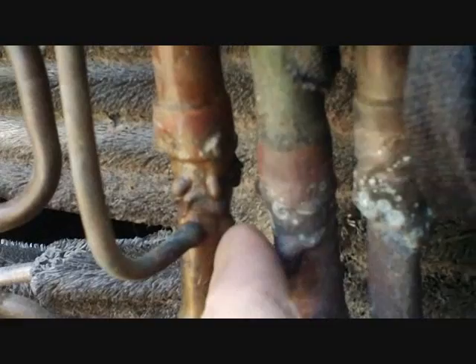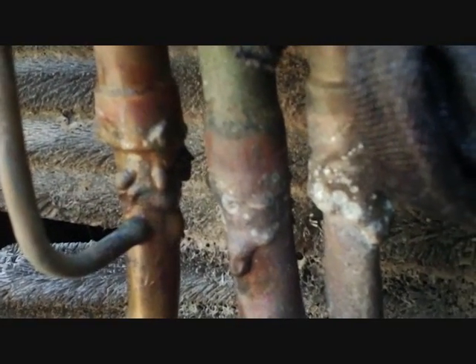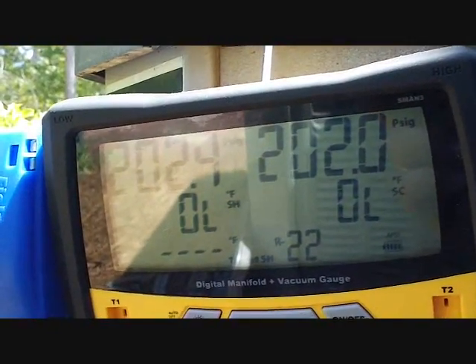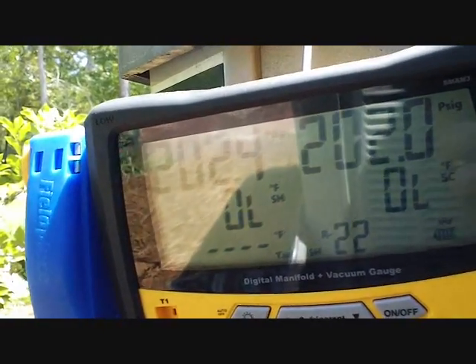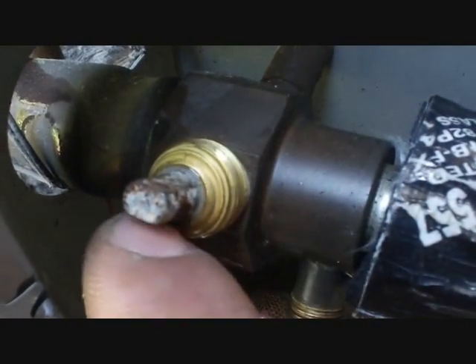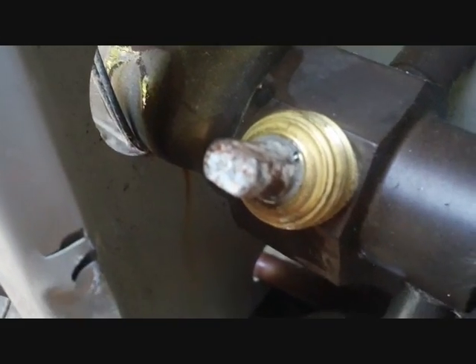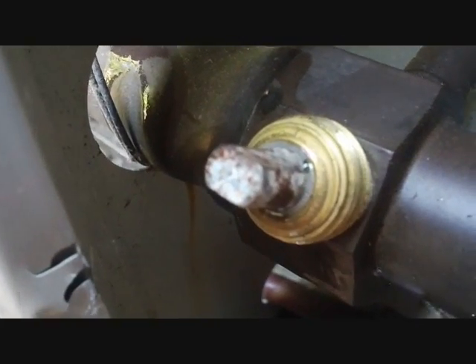Alright, here's our reversing valve wrapped up with wet rags. This is the area the leak was at — of course it's a very difficult area to braze. We're gonna try to get in there, seal it up, and then pressure check it. I have pressure on the system — it's fallen a little bit since I started after I made my repairs. Not very fast at all. I don't hear anything but I do see bubbles appearing around the rim of this valve — lots of small bubbles. So I'm gonna attack this with Nylog to counteract this little leak, go get something to eat, and hopefully the pressure will not have changed at all.